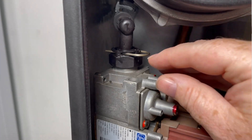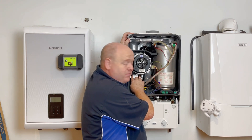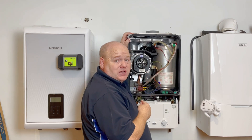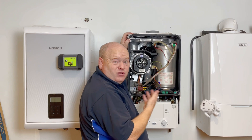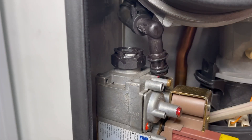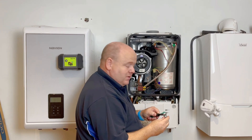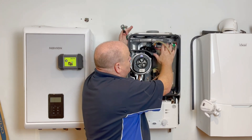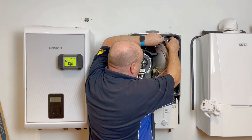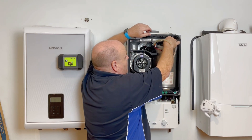To strip this down, take the pin out of the gas pipe. Always check that gas pipe — you can get the new burner seal with the gas pipe included and change it at the same time, because they can split over time. Pull the gas pipe out, disconnect the fan, stick the wires off the fan. Then get a ratchet spanner and a 13mm spanner. Depending on the model, some have a nut on top and some have a clip.